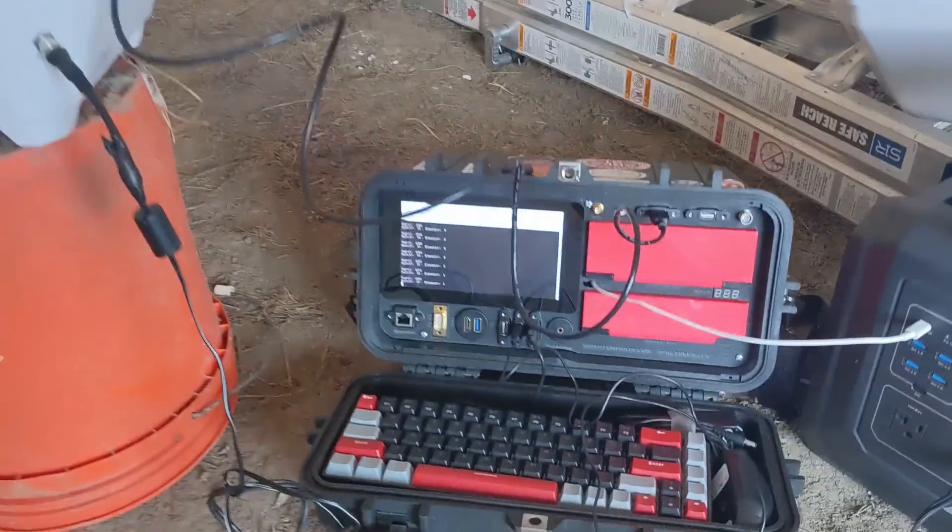It's been about three hours — I've been down in the tunnels at the main Sandland project — so it's time to take a break and go back upstairs and see how the satellite dish is doing. Three hours and this thing is still going. Limitations with the firmware on the brain there mean it has to stop for one second at each dish position, so it takes a long, long time to do a full sky survey. There's really no point in it aiming this high because it's aiming past the geostationary satellite belt right now, and that's mainly what I'm looking at. This thing is tuned to about 12 gigahertz, just looking at TV satellite transponders, as well as some reflections from trees and maybe the structure of the dome. But for completeness, we're going to let it continue and finish the scan at the default settings because that's what I used last time, and I'd like to get as close a comparison as possible.